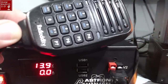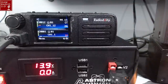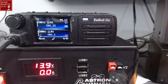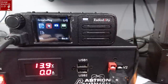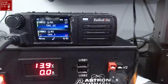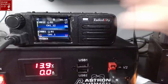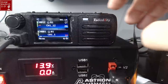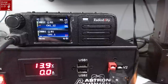On the microphone itself there are four more buttons: P4, P5, P6, and P7, which are also programmable. P4 right now says 'cannot run' — that's a digital feature. On the digital band, P4 is a contact list. P5 is a create-message function for sending text messages over DMR. P6 locks the screen and says 'long press menu to unlock.' P7 doesn't really do anything at all. These are the default settings for P4 through P7 on the microphone, which are programmable — you can do it in software.